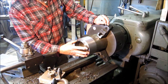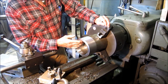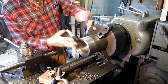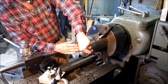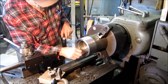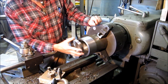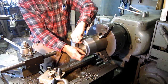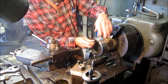Is that going to be too loose? That's a miss. We're going to be cutting this off and grabbing the next one. We've got enough bore to give us two bearings, so we're going to face this off and come in closer. We know that took our cut plus a spring cut — we should have taken a spring cut and re-measured. We probably would have been right on the money. We've cut that off and re-bored another one.